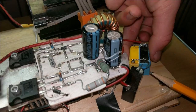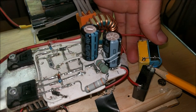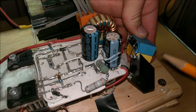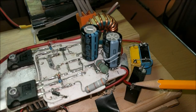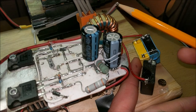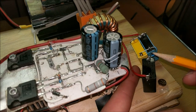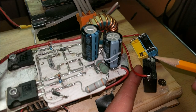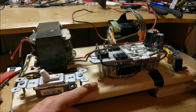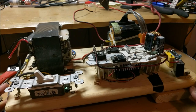The final part of my circuit — the capacitor bank — has been formed using three capacitors I found in various electronic appliances. When they add up in their parallel and series format, they form a 0.68 microfarad capacitor. You need to use very high gauge wires for this capacitor bank because it draws a lot of current — the resonant frequency passes current through these capacitors and they will get very hot during use. If you use too small a gauge wire, like I did initially, they will literally vaporize. This whole circuit is mounted on a piece of wood — two pieces screwed together, held by two other pieces on the bottom, kind of like Lincoln Logs — forming a very good base.